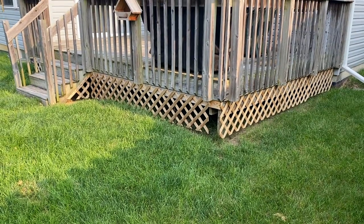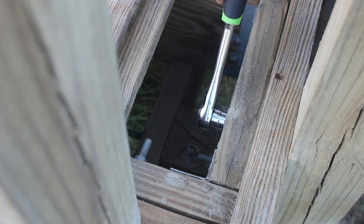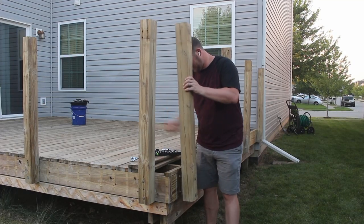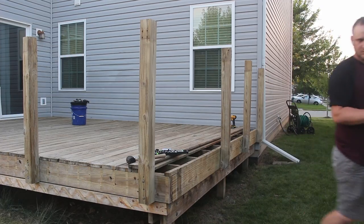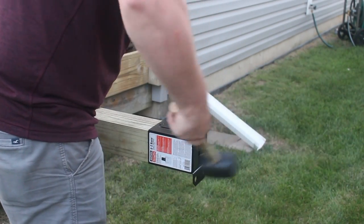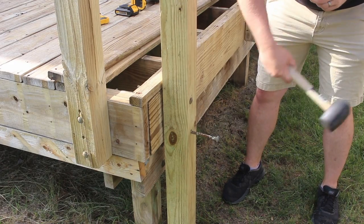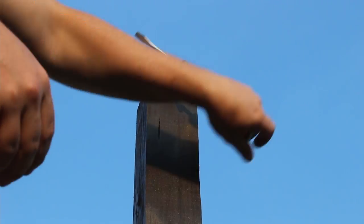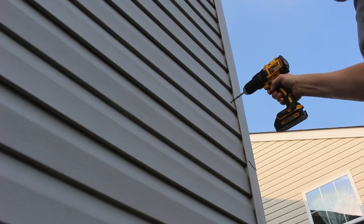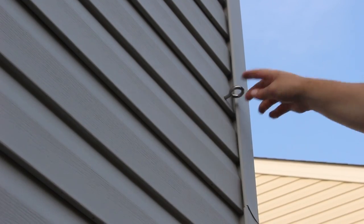Our final step here on the deck is to address this lack of shade — it can get so hot out here during the summer. To fix this issue, we're going to be putting up a big sunshade above the deck. We need to start by taking out one of the railing posts and replacing it with a much taller one to support the shade. To secure this 14-foot 4x4, I'm going to use two methods: the first is using a plate to anchor the post to the concrete footings of the deck, and the second is to bolt it directly to the deck, which should keep it nice and strong even in high winds. The post will serve as one anchor point for the sunshade, and the other three anchor points will be on the house. At all my anchor points, I'm just drilling holes and threading in large eye bolts, which should be plenty strong to hold up this canopy.